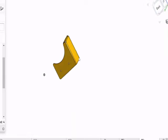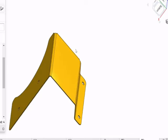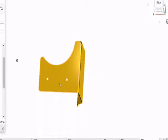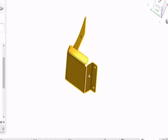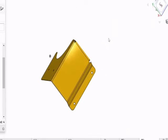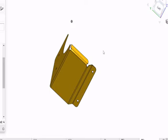This piece is going to fit around where that intercooled air comes back to the intake manifold on the left end — that's what this circular cutout is for. Again, it's going to come to you as a flat piece. It's going to have a bend here. We're going to bend everything else away from this face around the right-hand side, and then there's a jog back in here that goes about 45 degrees on this piece, then flattens out to be parallel to this face over here. You get something that looks like that, and then this flange on top bends over 90 degrees. Hopefully that makes it easy to see how to bend those.